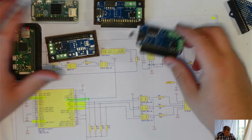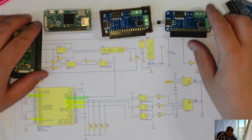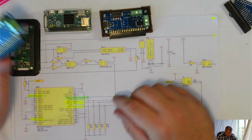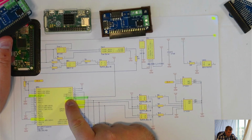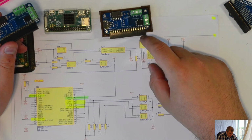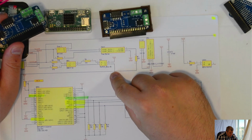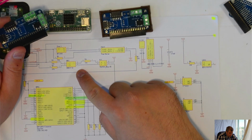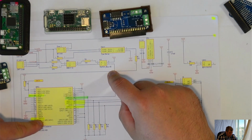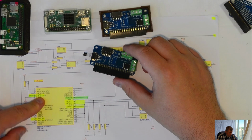When you do the programming of your Raspberry Pi, to be able to control the output, the Triac is connected to GPIO 13. The GPIO 18 comes from the bridge rectifier. The temperature sensor is connected to GPIO 4.